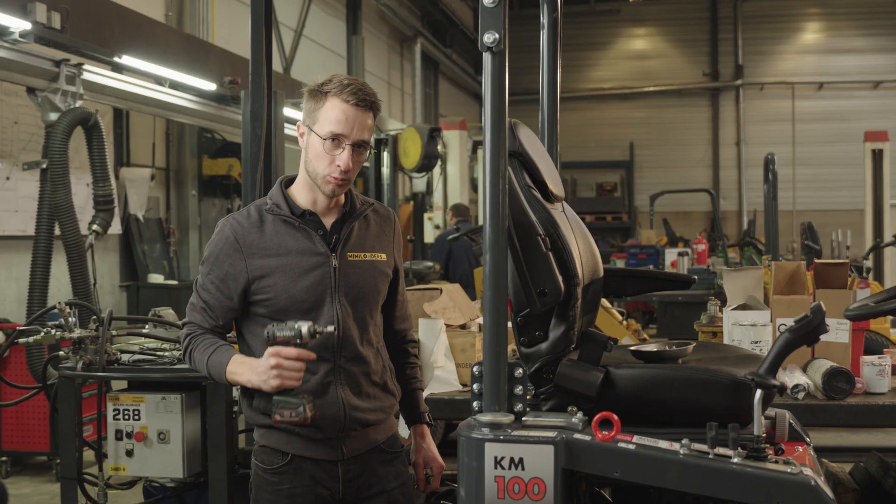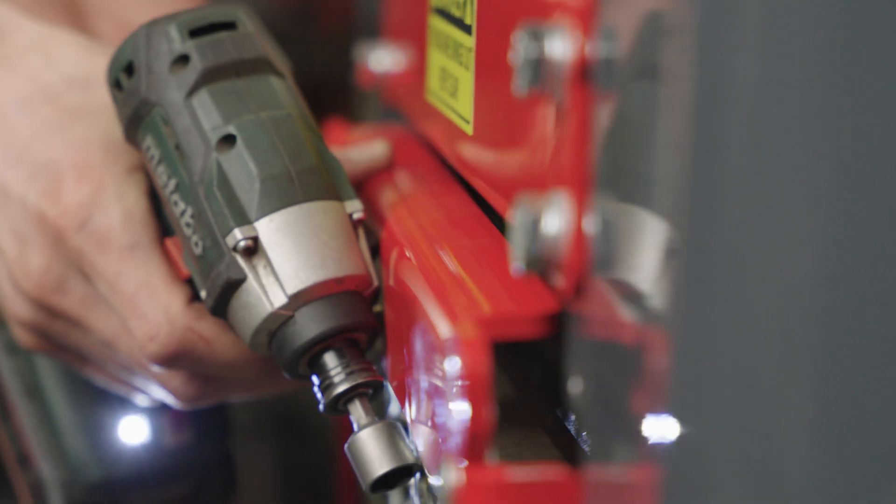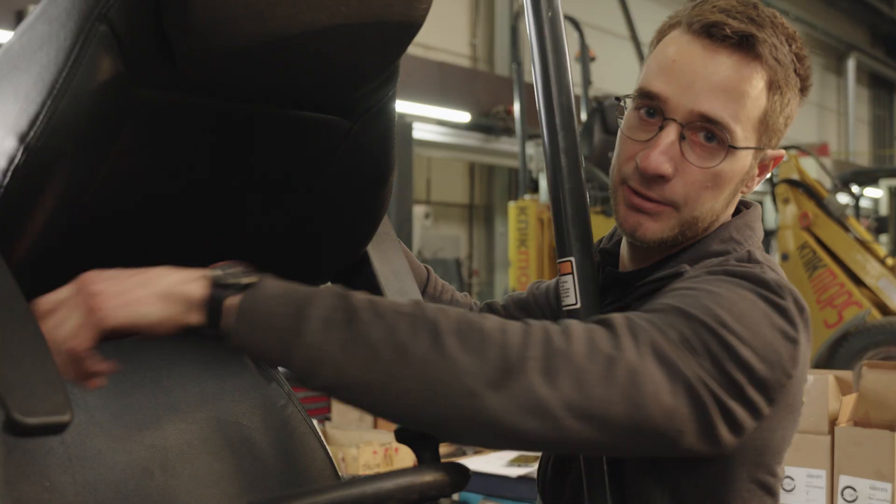We use a metric 13 to remove the rear grille. For complete access to the engine, we push the seat forward and secure it to the steering wheel using the seat belt.